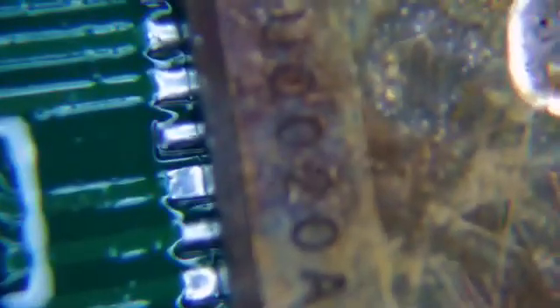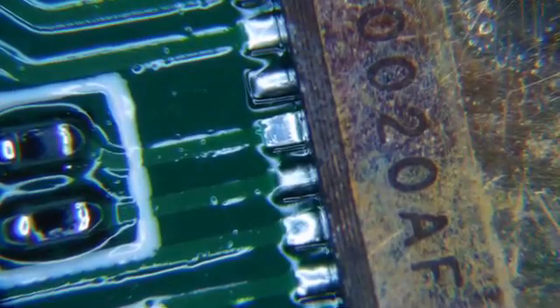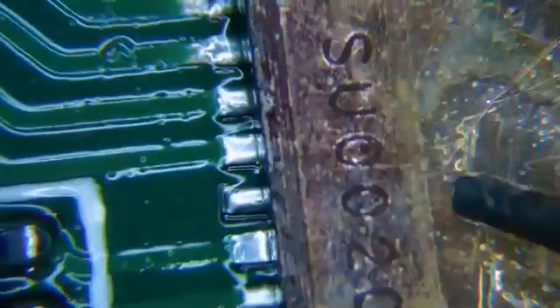I'm going to let up and let the chip cool down. I don't know if I like what I see. Here's the problems I have — I think people run extra solder on it. Now look at all these legs. So much solder got sucked in there, the whole leg got flattened. So where I'm looking at now — I can run along the chip right there. I noticed how they do it from the factory: there are all these balls that stick out. But it's not to say the solder didn't take. We've got a good line here along this edge, it's pretty uniform. These guys look okay. These guys look weird. These guys look like they never even really melted. But the lineup's okay, everything's okay. Here's the top — looks like we've got some nice balls up here. This chip is cooling down. I'm going to switch cameras and show a quick check to see the effectiveness.